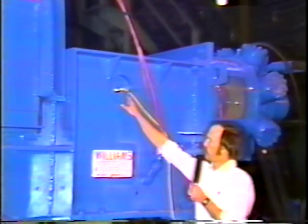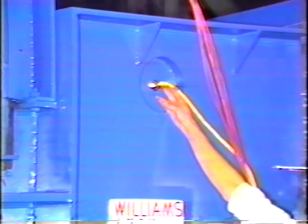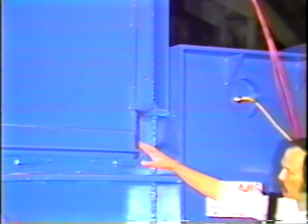Located on each side of the gearbox is a solid-state proximity sensor which takes note of shaft rotation. Should a jam occur three times in sequence, an automatic tramp rejection sequence will be initiated. Upon that sequence, this door will automatically open, as you see now.